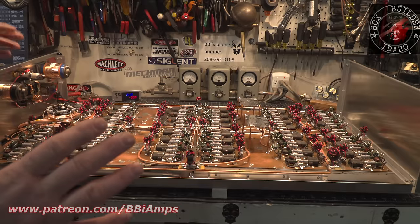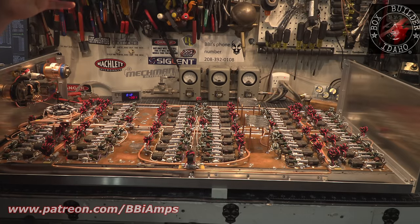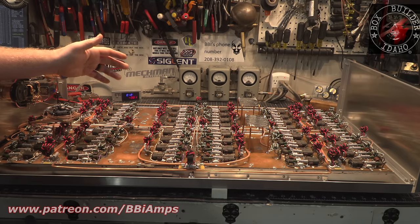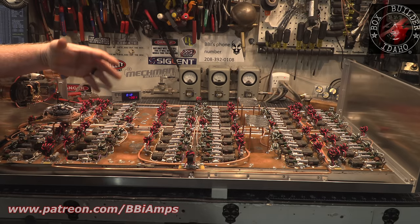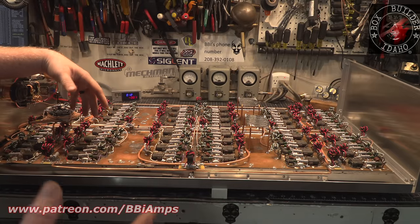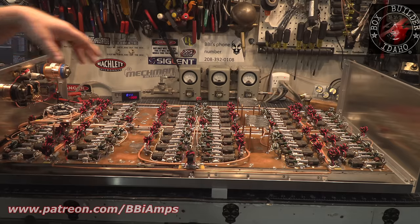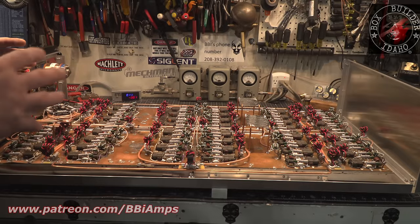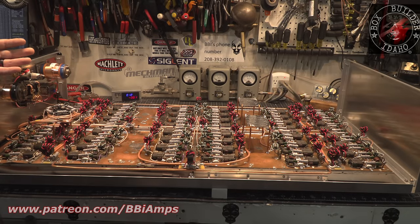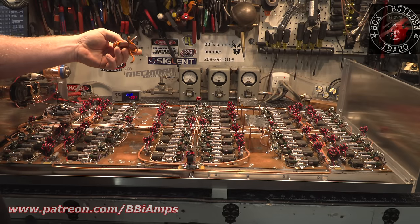If we think about it and do the math, let's say that we put 2,000 watts in this box. The size of the splitters that they had spoke to the inefficiency of the combination splitting circuit in here. They had these giant toroids on the output, so we went and built these new combiners. You guys have seen that already. On the input side, they had these massively overdone combiners, which I don't know the material makeup of.